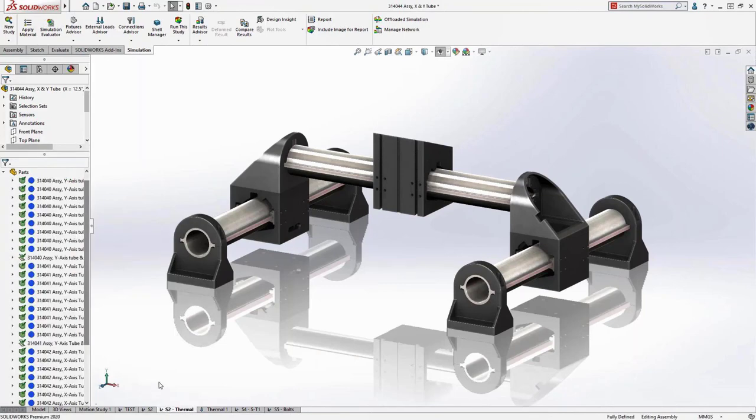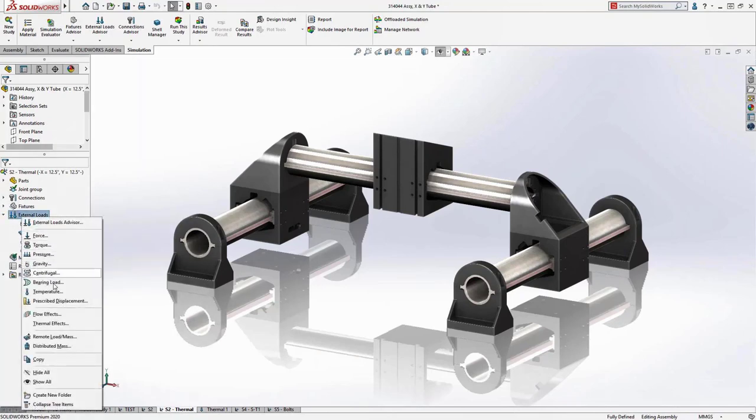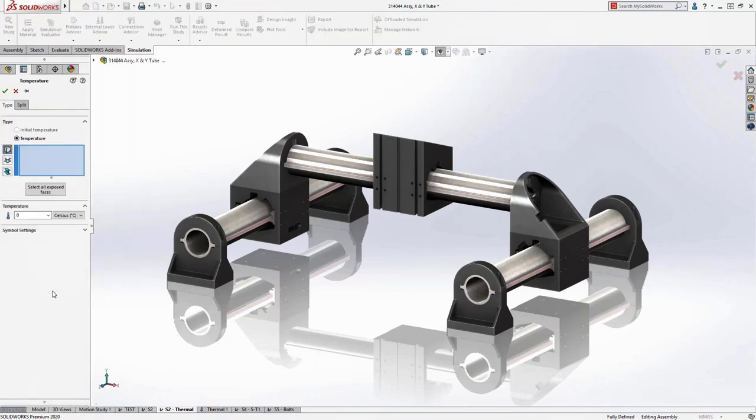Now, that's fine for static stuff, but when I want to incorporate thermal loads, for example, for expansion and stress in there, I couldn't use beam elements. I'd have to actually mesh those with 3D mesh geometry across those thicknesses. It would take a much bigger mesh and a lot longer to solve. Now I can just basically mix them.